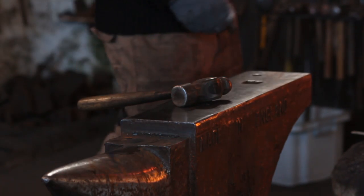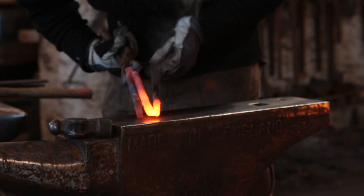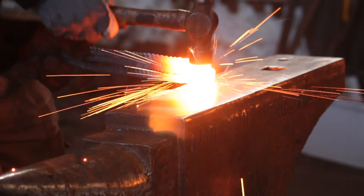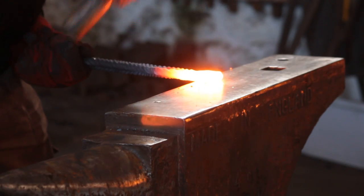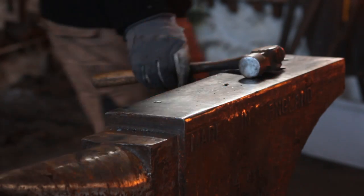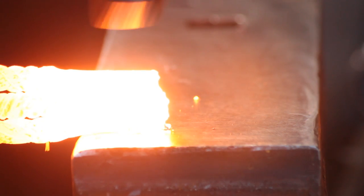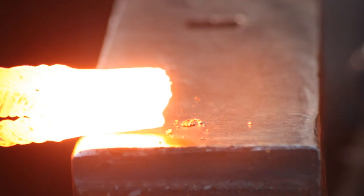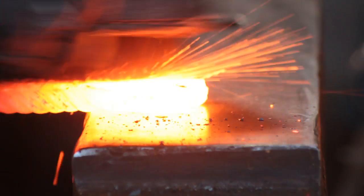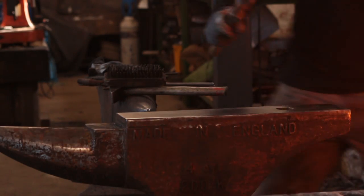Take a nice easy welding heat and do the other side — I'm probably going to have to tack this together as well. I say that like I don't know what's going to happen; I shot this video yesterday so of course I know I tacked it together. This is the second side tack — I'm not doing the full weld there yet because I need to tack up the opposite side still. Then for the opposite side, take a full welding heat and weld it together with the wide-faced hammer. Give it a good scrub between heats, then weld the opposite side.